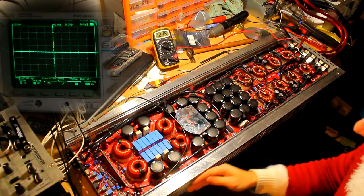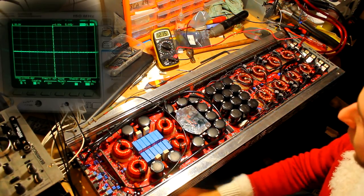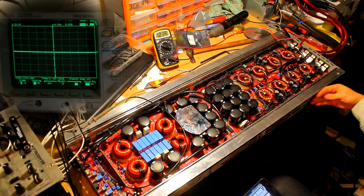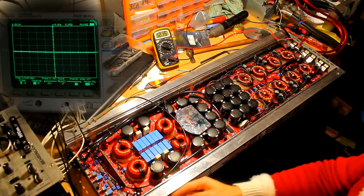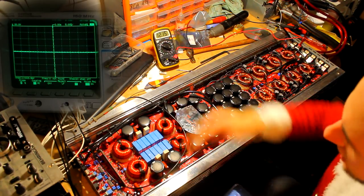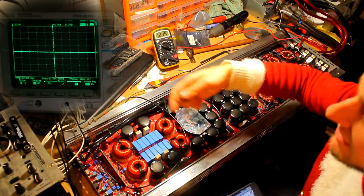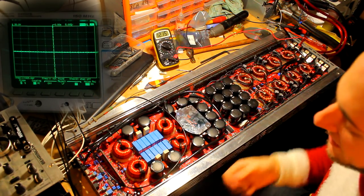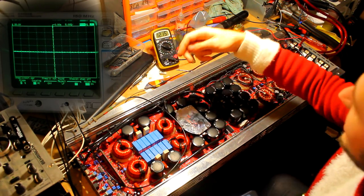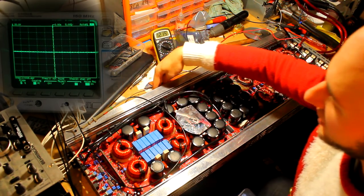And yeah, the amplifier's heatsink, it's not getting warm or hot as such, but I can tell that it's not room temperature. Like, this side, the power supply, feels cold to the touch. This just feels normal temperature, like room temperature to the touch. So the amplifier's outputs are generating some heat, obviously, to do this power, and we can feel that equally along with the whole heatsink here, which is ideal. You don't want any hot spots on the heatsink.